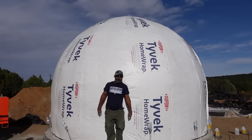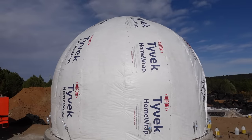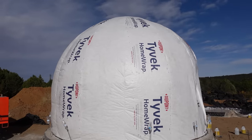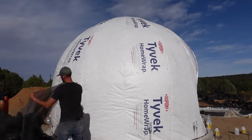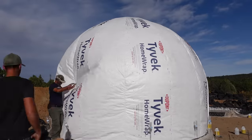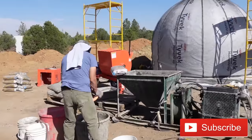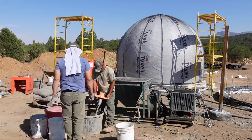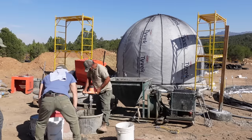This is the airform I made. We inflate it, and when you inflate these airforms for the first time, that process is called the birthing. What you're going to see next is a fiberglass reinforcing mesh that we slip over this Tyvek airform. This mesh serves a few purposes — the first is to give the cement something to adhere to, because the Tyvek is very slippery. Without it, I'd have a hard time getting the cement to stick without doing very light coats, but the fiberglass lets the cement grab onto something.